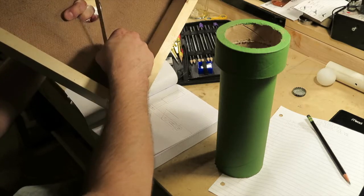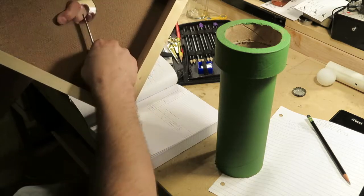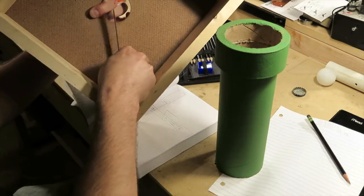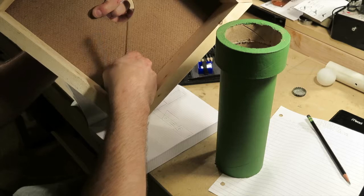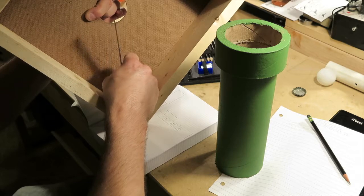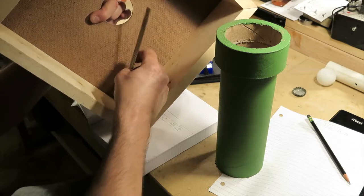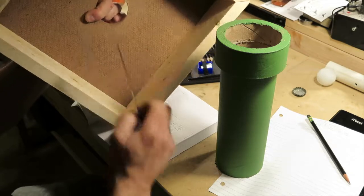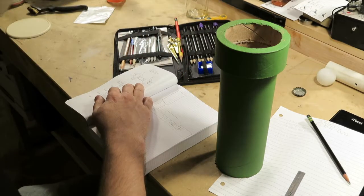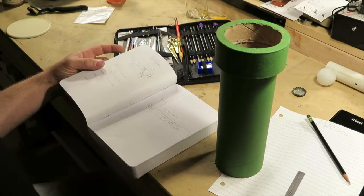We'll have this lever system mounted probably as long as we can, so we'll use this corner. The servo will probably be over here in this corner with a pivot close to it where we can take advantage. This is 3.5 inches here. Take advantage pretty much of the whole 3.5 inches of travel there. Physics won't allow it to be a full one probably, but that's going to be it. Hopefully we get this together before the child's birthday party that we're preparing it for.